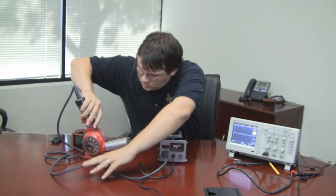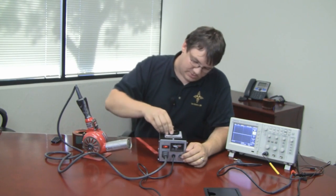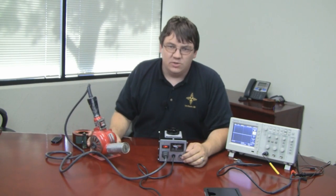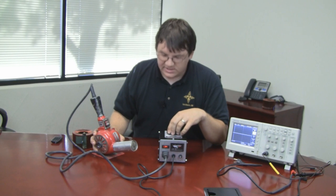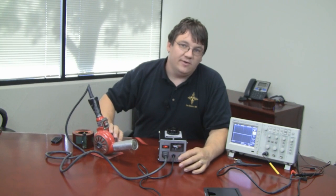A lot of these heat guns have absolutely no control, or very coarse control, over the amount of heat they put out. That's where our variac comes in. When I turn on my variac and turn it up to about 120 volts, you can see this runs at full bore — you can hear it. But this is too hot for my application, so I'll just take my variac and turn it down. You can hear it's running much slower now, it's much cooler, and I can adjust this in real-time as it's running and tweak it for the exact heat output I need.